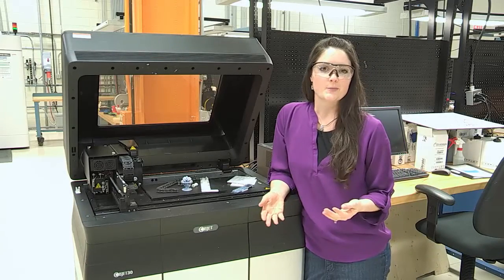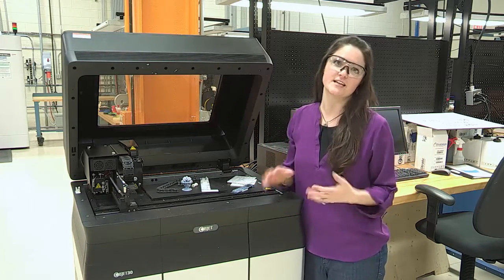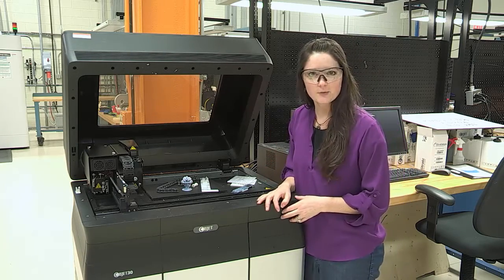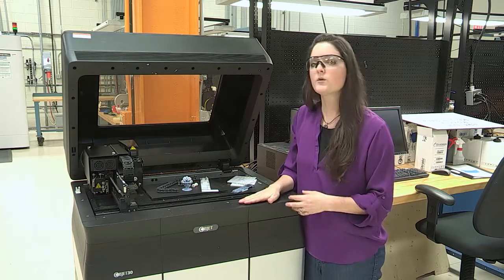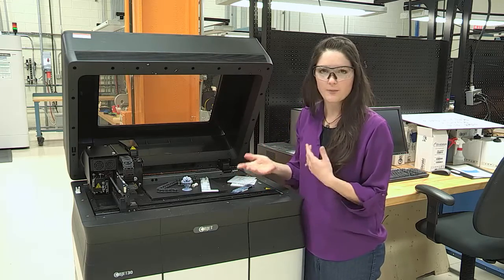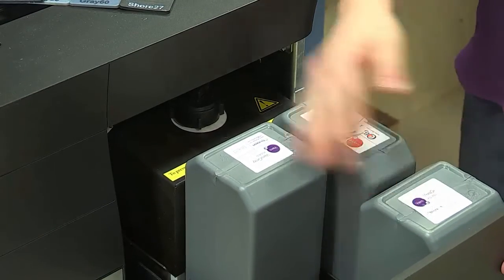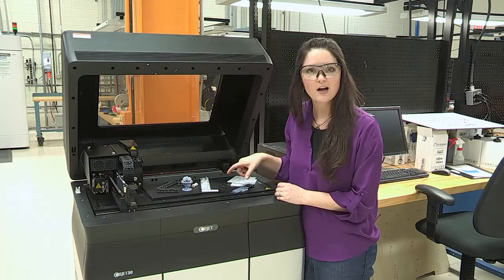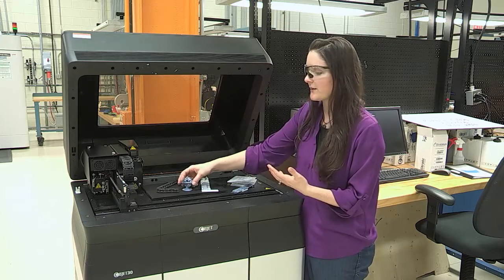The most important thing to remember about additive manufacturing or 3D printing is that there's more than one way to do it. In fact, there are about seven different technologies commercially available right now to actually 3D print something. This is our second technology — it's called PolyJet. With PolyJet, we're depositing a photopolymer or a liquid resin with an inkjet nozzle into the shape of the layer. This liquid resin gets piped out through the inkjet nozzle and sprayed into layers. We spray a layer of polymer, cure it with UV light, spray another layer, cure it with UV light — spraying and curing until we build up these three dimensional parts.